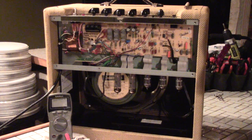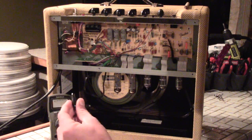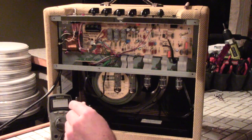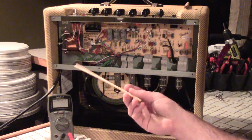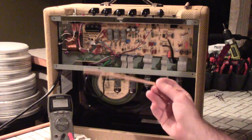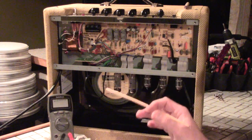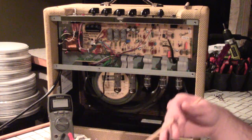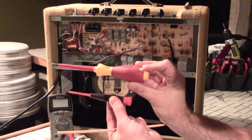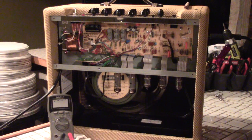You need insulated leads that come with multimeters — they have to be insulated, meaning they have rubber shielding. If you have an unshielded metal clamp, don't use it — it's going to conduct right into your fingers. It's also handy to have a wooden chopstick, which is great for probing around inside the amp to check for loose connections without conducting electricity. I also use electrician screwdrivers rated for high voltage even when the amp is off and I know the caps are drained.